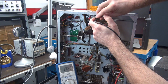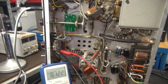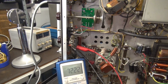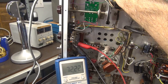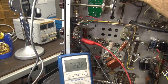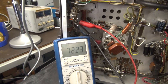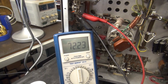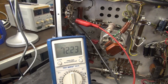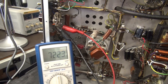I'm going to re-solder that, make sure it's stable, and then retest. All right, I think we're good to go. On the 200-ohm scale you can see the modulation transformer resistance — tugging around on these wires, rocking around the terminal board — it appears to be rock stable. I believe the mystery of the modulation dropout is solved. Get it back together and test it.